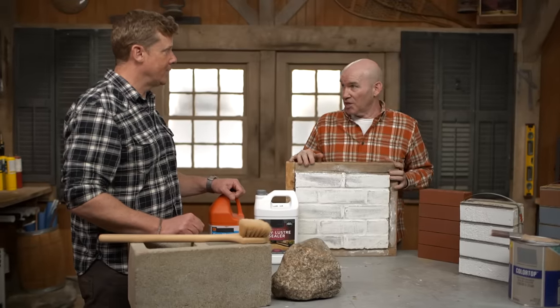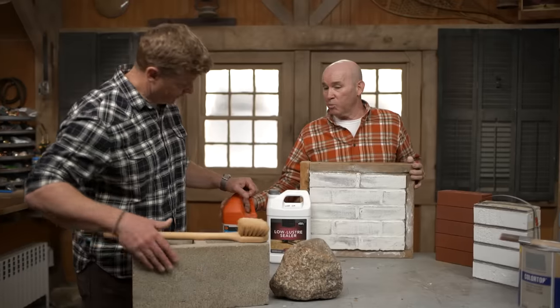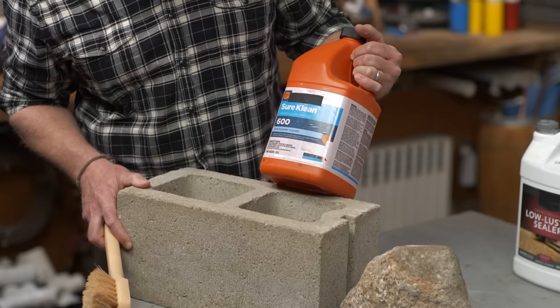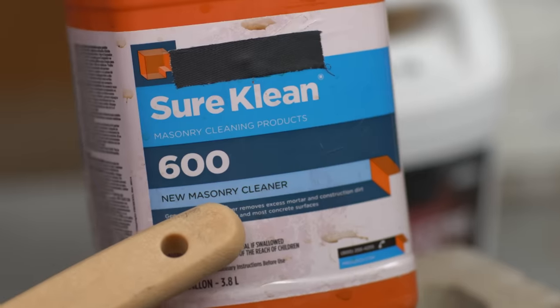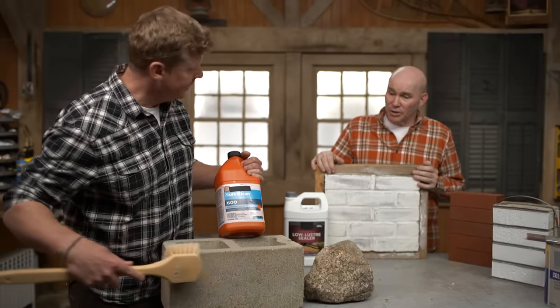And if I want to seal them outside to protect them, what's the process? So first thing I would do is make sure all of the masonry is intact — any loose joints, any broken brick, get them out, replace them, and replace that mortar joint. Get a solid surface to start with. Second thing I'm going to do is wet down the wall, then apply a detergent. Not an acid or anything like that? That's right, this is very environmentally friendly. The acid is actually the opposite. And this one actually says masonry cleaner right there. And I presume this scrub brush gets involved. A little bit of scrub, right.